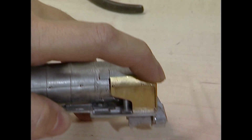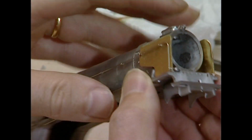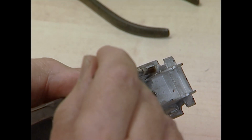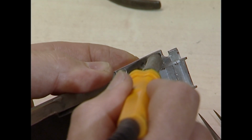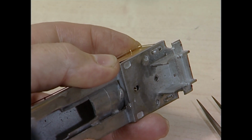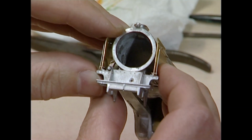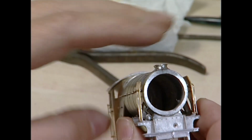And you should then find that the solder has run through beautifully. The deflector is ever so slightly turned in. That's better than it turning out, so I just need to reintroduce the iron just to ease it slightly. A little bit more solder, not too much, and you'll feel it move, just a twitch. I think that's got it. Check again. There we are. You can do a little bit of teasing, that's allowed, not too much, otherwise you'll fracture the joint.